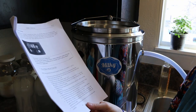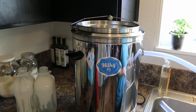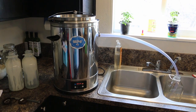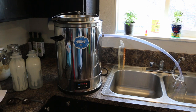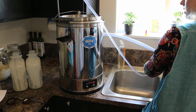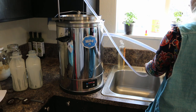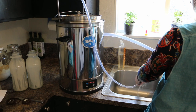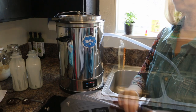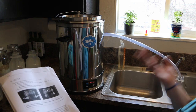Put the inlet hose in the hole and the outlet hose on the cooling connector. I've got to open it enough to get it over the wider part of the hose so I can clamp it down. Once the milk is added it starts to sink a little — the hooks are now less wobbly. The instructions say: fill the pasteurizer with water using the fixed inlet hose until water is coming out of the outlet hose. I put that outlet hose in a bottle to limit contact. There's a max line on the inside of the pot, but you actually fill it until water comes out the outlet.